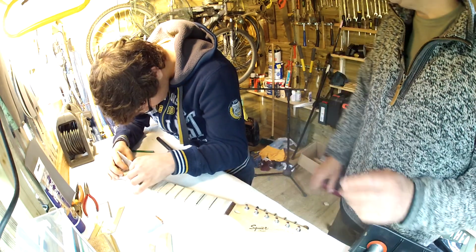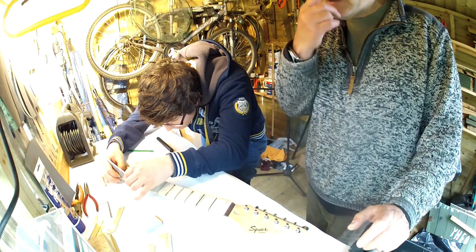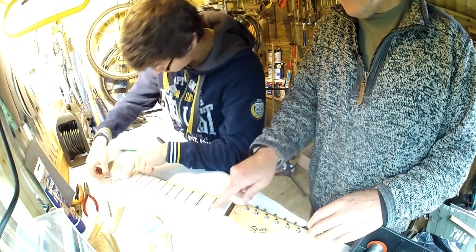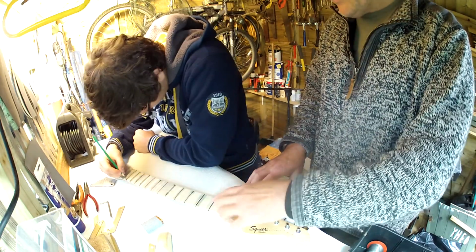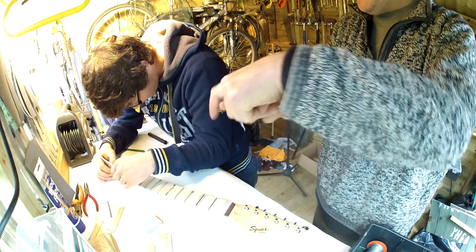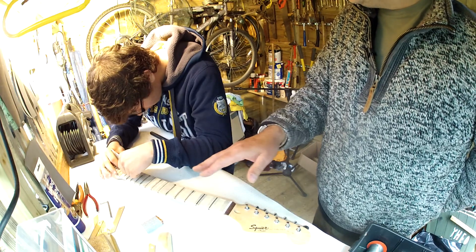Again, if you've got a run of them that seem to be only high at the edges, it might be showing you that what's happened is that it's been badly fitted. When you put frets into a guitar, not that I've done it, but seen it done, you have to pre-bend them on a special machine with a setting to put a certain amount of bend for the guitar you're doing. I think a Stratocaster like this has a neck radius, which is the degree of bend, a fingerboard radius of something like 7.25. So you set that in your machine and you feed this fret wire into it, and the bending machine squeezes the wire as it goes through to that ratio, and then you cut it off. And if they got it slightly wrong, then you might find frets seeming to spring up at the end, because they might be, in a sense, the wrong radius.